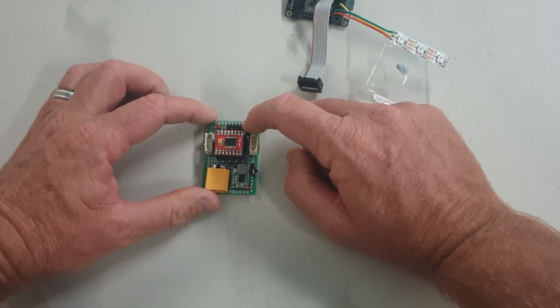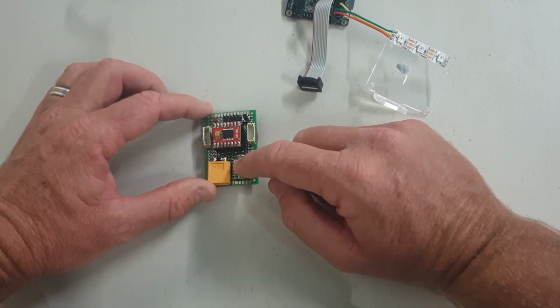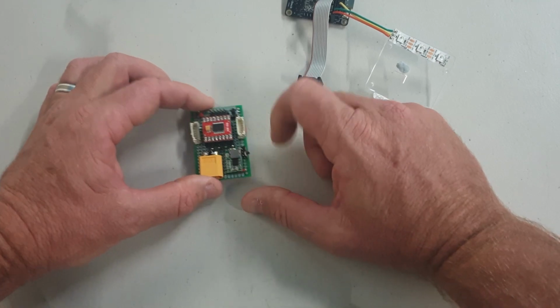Now on this perf board, that's just simply an H bridge to control the motors. There's 2 little plugs here to take the plugs for the Maix block motor. I also have a little user switch here. I have a plug for the battery to plug in and a voltage regulator with a tiny little on-off switch I made. And it's pretty simple.